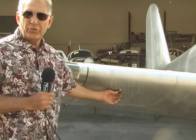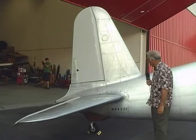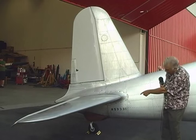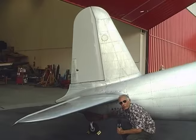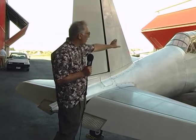This right here is what they call a jack point, and it's fixed on this airplane. So if the airplane needed to be jacked up for maintenance — replacement of tires or brakes — you could put a ground jack on this on both sides and jack the airplane up. We're down at the tail section here. You can see your vertical stabilizer and horizontal stabilizer here. And you have a steerable tail wheel down below. This boot down here is just to protect this area so dirt and debris won't get in. This is a BT-13A model. On some of the BT-13Bs, they actually had wood fuselages — the fuselage section was made out of wood.